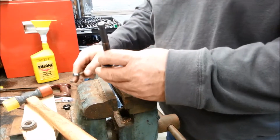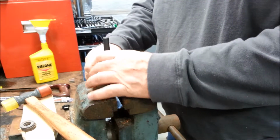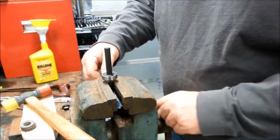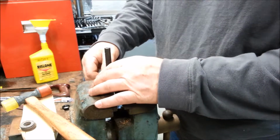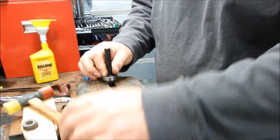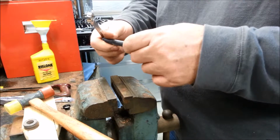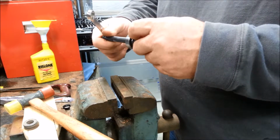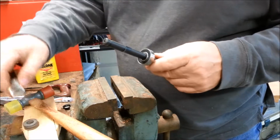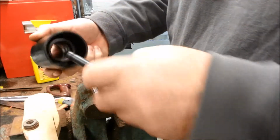So I found a way to do this. The inner race of the bearing is against the wrench. Well, it moves nice and easy with a good solid anvil behind it. Okay, I can move the E-clip a little bit, which means I could uninstall it if I wanted to. I don't want it hard against the E-clip, so I don't break this plastic wheel.